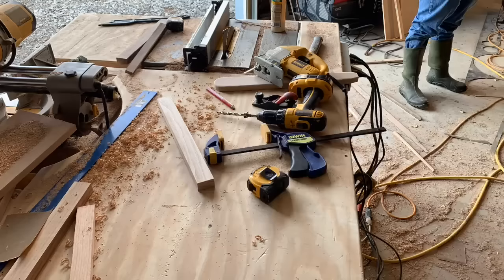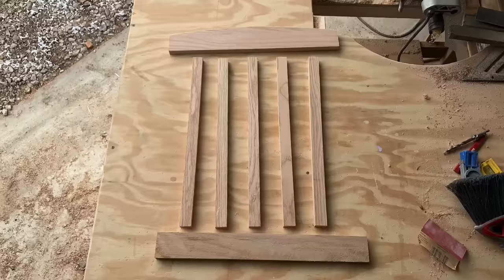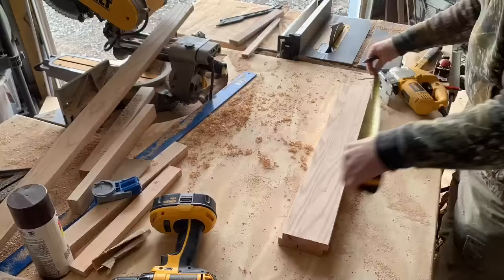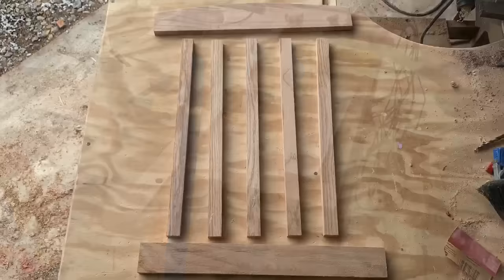You can see I cut out notches for the back of the backrest, which you'll see when I apply it in a minute. I'm also going to put a pocket hole there to hold it attached to the chair. Now I'm going to work on the top portion of this backrest — I put a little bit of curve in there, but you can make this however you want. I'm going to use that 48-inch T-square again to get the curve I want, and this width should be 21 inches long.